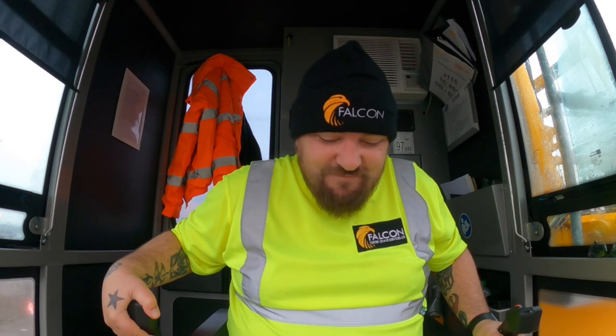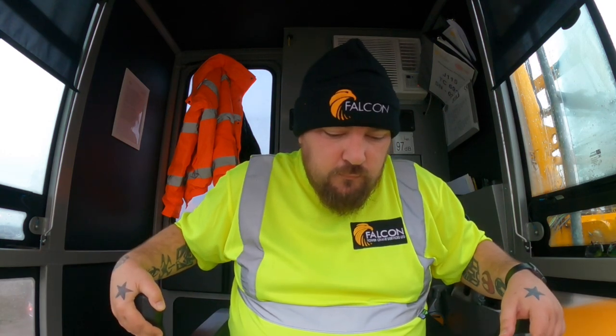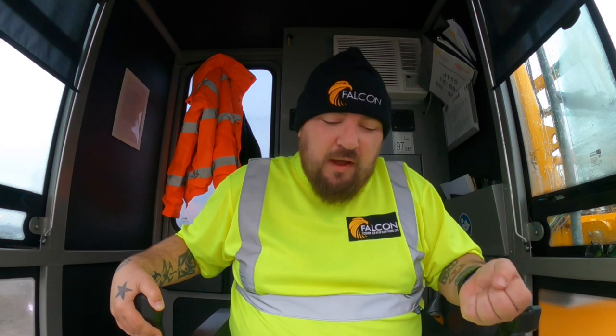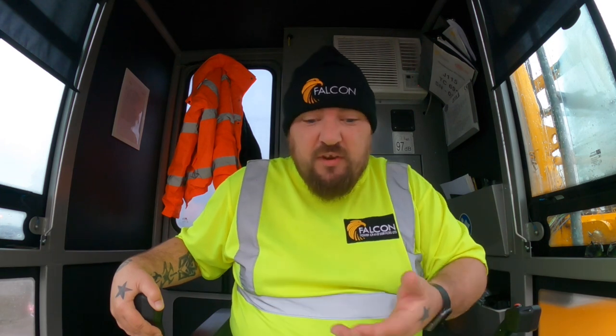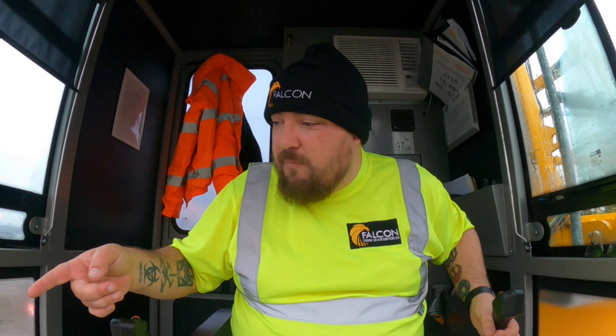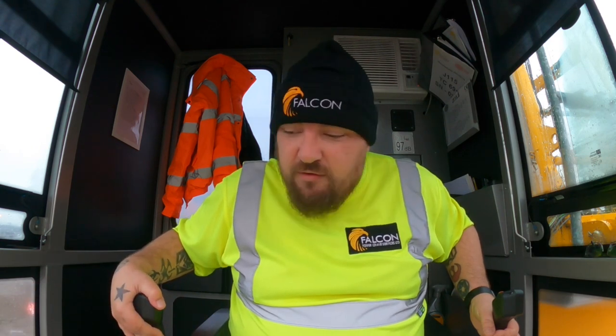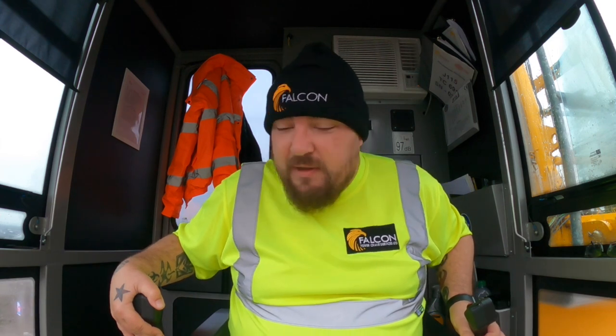Tower cranes are put up by another crane. When I'm doing a lift, the slinger talks me through on the radio — taking the weight, and so on. What I've got on the lift right now is a stillage with some silver legs, weighing 700 kilograms. I can see that on my screen here with the weight. I'm out at 29 metres. You go up in first gear just to take the weight, then stop to make sure it's safe before you fire away. I've got my other screen — my anti-collision display — down here to see if there are any cranes nearby. I can see TC2 coming up behind me, so I'll have to get out of his way.